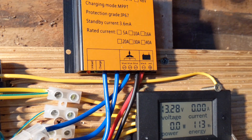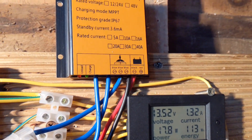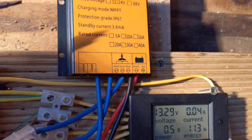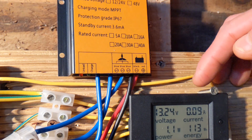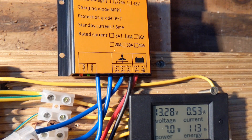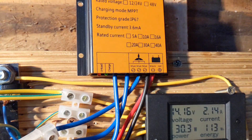What's up YouTube, it's Friday morning, not much wind, and I decided to get this thing connected up. I've got it connected to one battery so effectively it's running as 12 volt. What I want to show you is if it goes over 14 volts you'll see a little light underneath here come on. I'm unsure about whether the meter is reading the amperage correctly — when I had it on 24 volts I only saw it go up to two amps. I'm hoping this goes above 14 so you can see the unload light come on, which is effectively a brake.